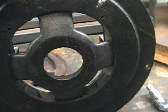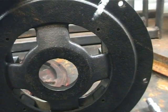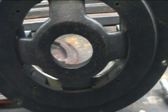I've just given this a blast of compressed air, just to get rid of the brush dust from it. From the com end, the motor is going to look as if it's rotating clockwise. So we have to advance the brushes opposite to that, which means anti-clockwise.